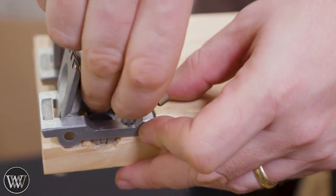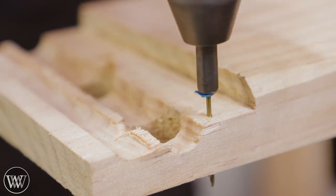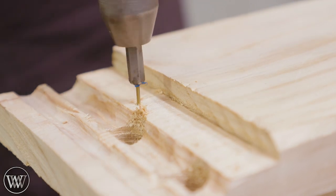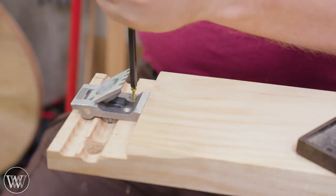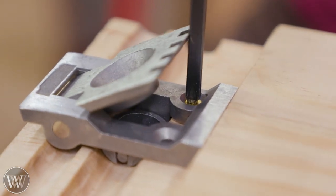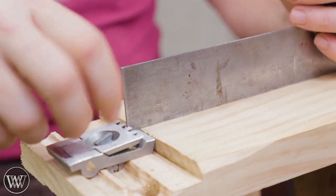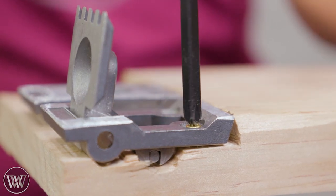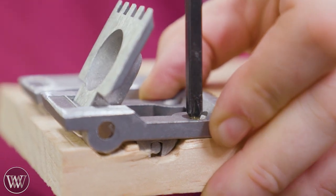You can see how I have them spaced out. I need to make marks — I couldn't find my awl, so I used my depth stop. Use what you've got. Pre-drill holes, then put in these tiny little brass screws to make sure they don't move around. Then it's just reassembly: there's a spring inside and a bolt that goes down through it. You can adjust the end stop to whatever height you need. If you're working with thin stock, you can have a really thin piece on there. They screw down, lock in place, and work really well — just make sure they're flush with the end.